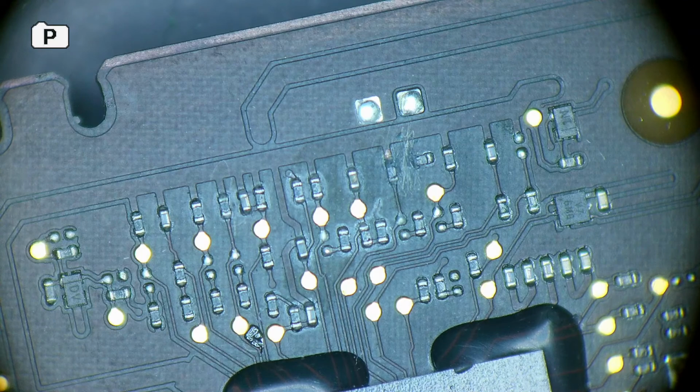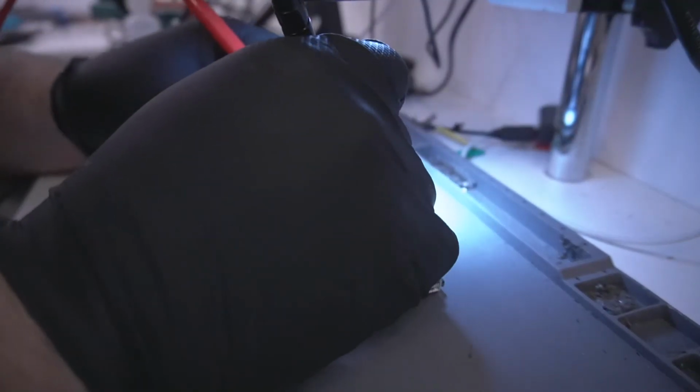If the resistor has an issue, pretty much all of the time it's going to show open line, or it's going to have such a high resistance that it looks suspicious. But if it's around a certain number, like let's say 100 ohms, or 100K, or 10K, or 50, or something like that, usually you know it's good. But we know it's good anyway because the MacBook is turning on in this case.